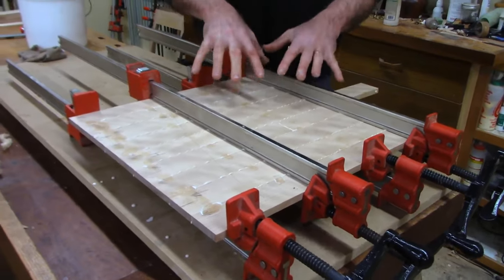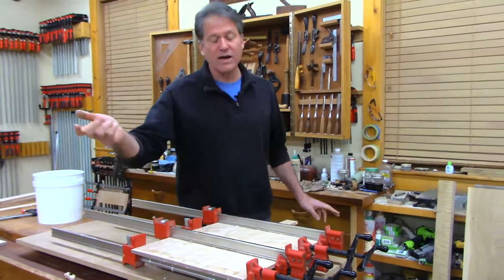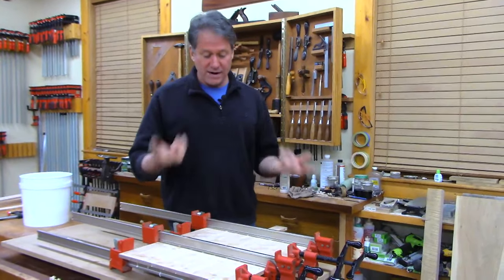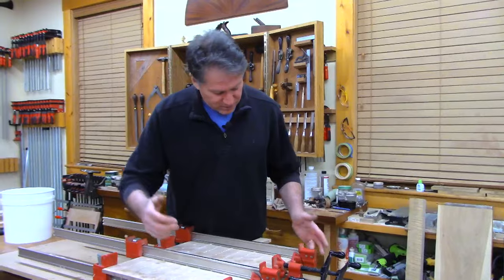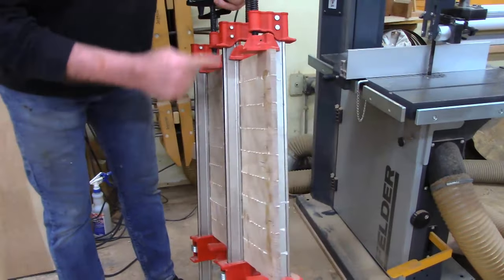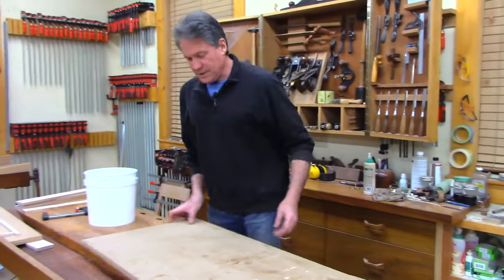Now what I like to do is let that glue firm up for about 20 or 30 minutes. And with a putty knife, I'll just come along and it'll come right off easily. If it hardens up overnight, and you scrape that, those little pearls are so strong, they will pull a lot of tear out on the seam. So you could go after it with water right now. But if you can even set a timer for yourself so you don't forget. I waxed these, by the way, before I used them. So, yeah, see how I'm getting a really nice alignment. And they're not going to stain it because of that new coating. All right, so let's set this aside.